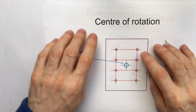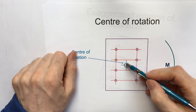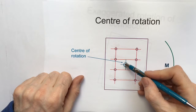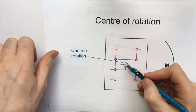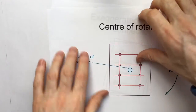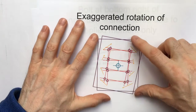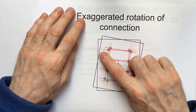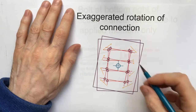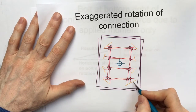The resistance of each bolt directly relates to its distance from the center of rotation. You can intuitively see that bolts further away work harder than bolts close to the center of rotation. A bolt placed exactly at the center of rotation would carry no force whatsoever. All other bolts carry shearing forces due to the plate wanting to twist. An exaggerated picture shows that if the plate twisted, all bolts would move in a circle, sheared in slightly different directions - bolts at the bottom sheared downwards, bolts at the top sheared upwards.